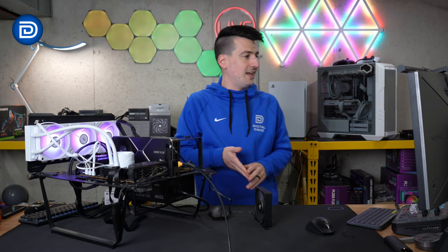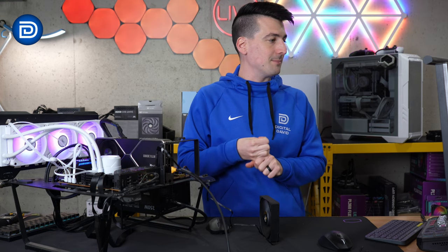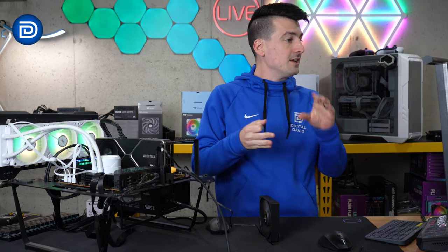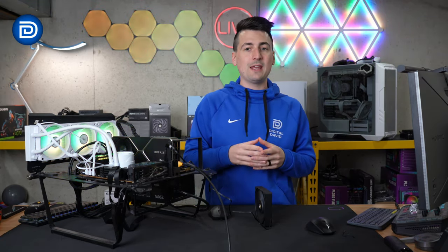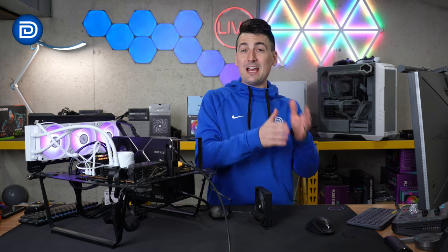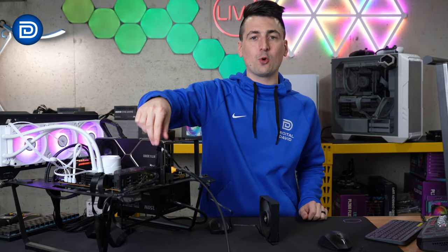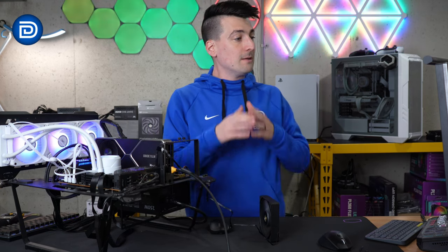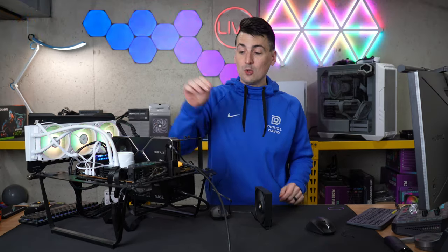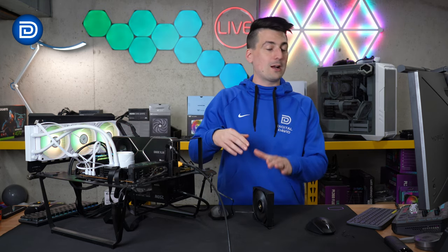So let's talk about the data. Without the low noise cable, at 25% we got 505 RPMs — that's the same performance with the low noise cable. Same for the 50% readout: 1,010 RPMs with and without the cable. Moving up to 75%, the same performance: 1,515 RPMs with or without the cable. It's not until we get to that 100% mark that we see a pretty drastic reduction. Without the cable, we peaked at around 2,030 RPMs. With the cable installed, we peaked at around 1,560 RPMs.